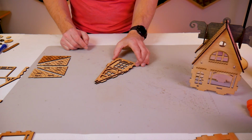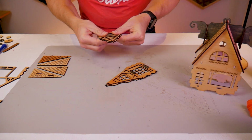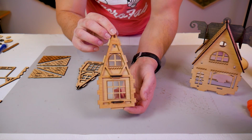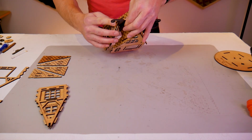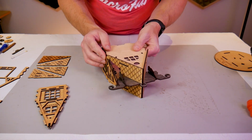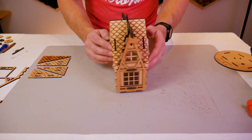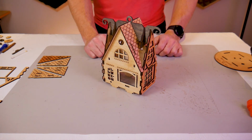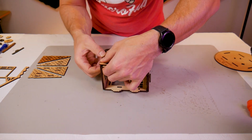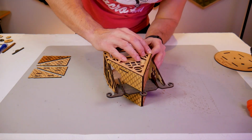This design package came with some very nicely illustrated instructions that were a breeze to follow. However, at first I thought I had maybe done something wrong because some of the slots were a little loose, but it became evident later on that this was done by design so that once you start to fit all of the other pieces together, it leaves a little bit of wiggle room for the tolerances. The parts that were intended to snap together with a reasonable amount of force did so perfectly as well, and so it seemed like the accuracy of the WeCreat Vision was definitely acceptable.